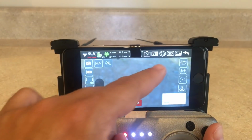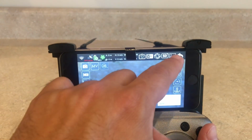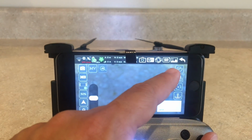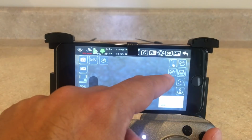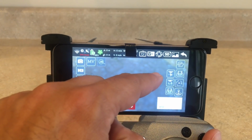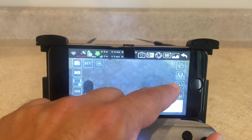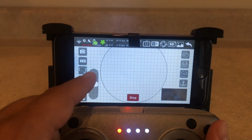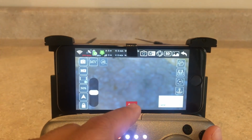The SD icon will allow you to change either from 2K or 1080p for recording video, depending on how strong your mobile device is. And you can also take 4K photographs. Here's the photo gallery to view stored videos and photos. And we have the automated flight modes here on the right. This one here will allow you to draw waypoints so that the aircraft can fly those waypoints. This icon below will enable either the follow me or gesture tracking mode, and the aircraft will follow your hand motions or follow you. And then you have right over here the circle me function. And then you have your return to home. You can obviously apply those while in map mode, where you can draw your waypoints and submit those waypoints. And then you can return back to FPV mode right here.